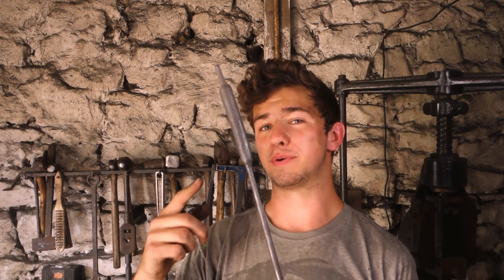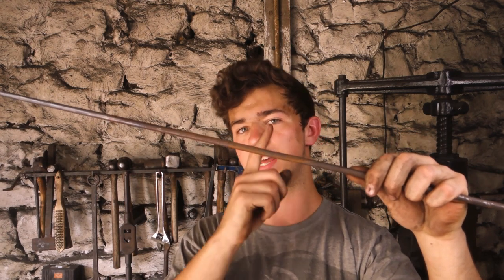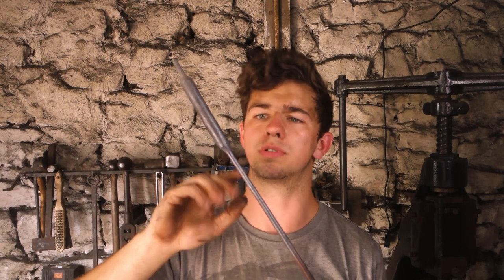I picked the wrong day to do forge welding — I am absolutely dripping in sweat — but anyway, we've got it welded on. There's no evidence here of the seams of the weld so it looks like it's a solid weld and hopefully it's going to be strong enough. I mean this is only a sculpture anyway so it doesn't need to be really strong, but it's nice. It's on this stem, so what I can do now is flip it around, forge a leaf out on this end, fold it in the middle, then do a second forge weld at that fold. Then we're going to have to do the second leaf out of a separate bar and weld that on after. I will come back and clean up this transition point as it's a bit gradual, but for now we can flip it over and get working on the first leaf.